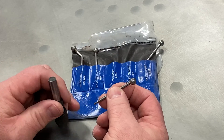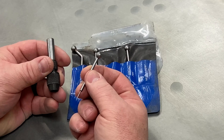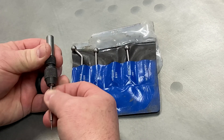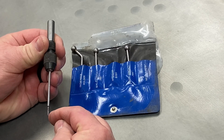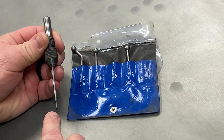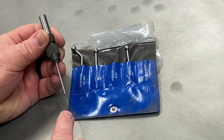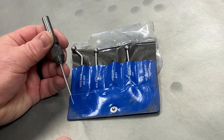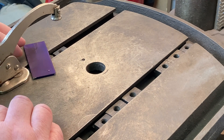I don't use the disc tip very much at all. The star of the show — and what we'll be focusing on today — is the needle probe. Once this probe is inserted into the spindle and snugged up, it will be trued to run absolutely perfectly, looking virtually motionless at the tip when the spindle is under power. That will allow us to position the work very precisely under the spindle so that we can drill holes to within just a few thousandths of an inch every single time.